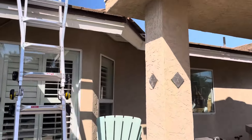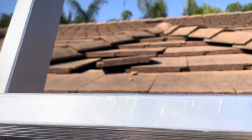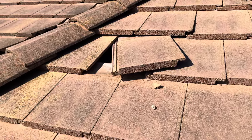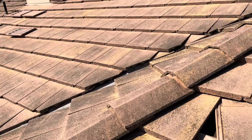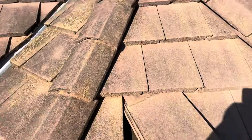What we have here is a flat concrete tile roof and the owner has been experiencing multiple leaks over the past two years. So what I went ahead and did is actually move a couple tiles just to see the condition of that underlayment. You can see a little bit of water standing on this portion right here.